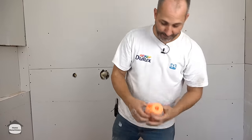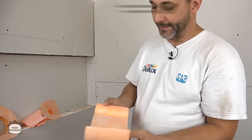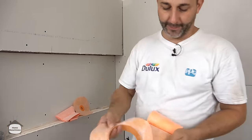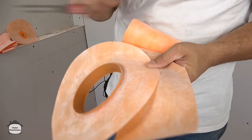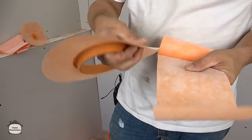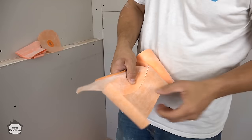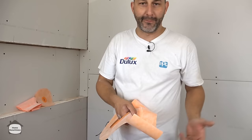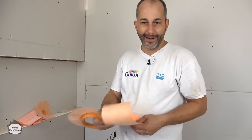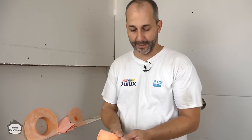And the basic principle of this membrane is really simple. This material, when it overlaps with itself, creates a bond that water can't force its way through, okay? This material has a property that repels water. So when you cement them together, it makes it impossible for water to work its way through there, unless it's something ridiculous like over 50 feet below the sea level. And we're never gonna have that kind of pressure on water in a shower. So that's where the waterproofing system comes from.